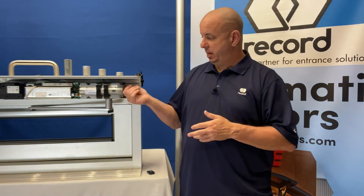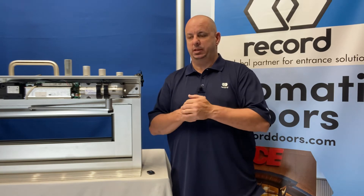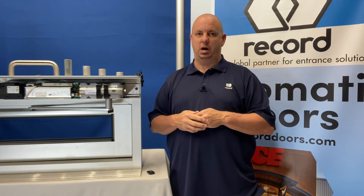For mechanical install, you need to make sure that the spring is adjusted so that the door closes without power, and you need to make sure that the sweeps and hinges — things like that — don't have binds that would require a door not to close.